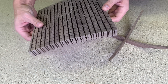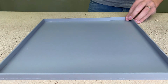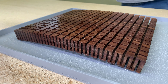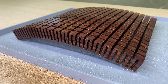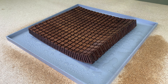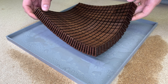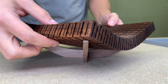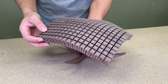Despite the sliced walnut board being quite flexible, and I could force it along the legs, I decided to use some water to release that tension in the wood even more. Now it is way more manageable than before — it feels more like rubber than wood. While the wood was still moist, I placed it on the stand and applied some weight from above. The next day it was totally dried and held the given form.